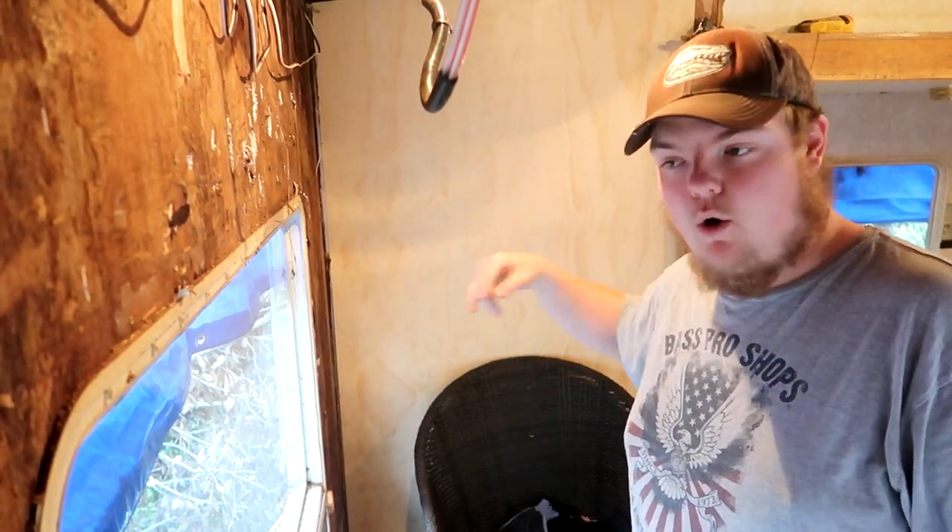I got it up against, held up with a chair. Come outside and you take the point of your Sharpie - if you got a fine point it'd be better, but this is all I had - and I just put it in as far as possible. That way it's not even with this, because if it's even with this your window inside trim is not gonna fit. Trace that along. I don't have a jigsaw at the moment, so we're gonna do the best that we can with a circular saw, and then I'll use a Sawzall with a smaller blade to try to make those turns.